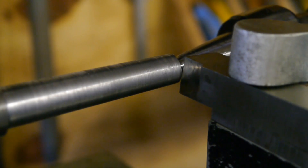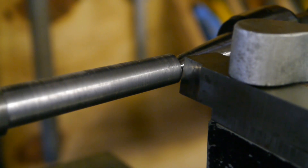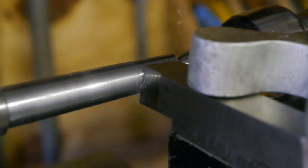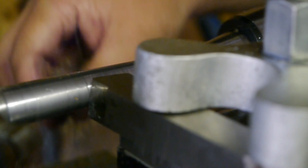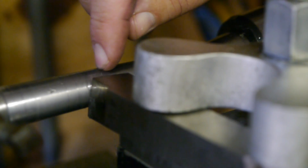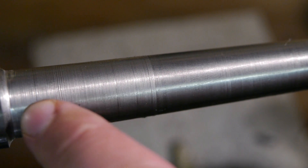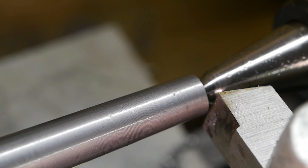So far the most difficult part has been turning the top slide at a consistent slow speed. The material is very difficult as well, and I keep hitting my hand against the tailstock. There is enough drag in the top slide to make it almost impossible to turn at a nice, slow, consistent speed. The shear tool is producing very fine chips — finish isn't bad! Up till here was cut with the shear tool, and this section was with the round nose tool. I've cut down the taper to more or less the correct size and will now try to clean it up with the shear tool.